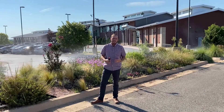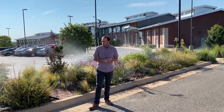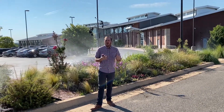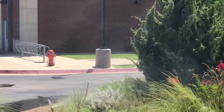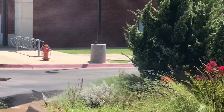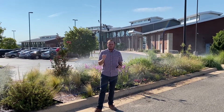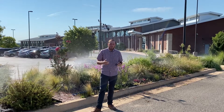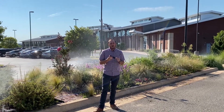Hi, I'm Josh Campbell with OSU Extension and today I'd like to talk to you about managing high pressure in your home sprinkler system. You can see behind me here, I've got our sprinkler systems running. High pressure is pretty common in most home sprinkler systems and it can be identified by hearing high hissing sounds, seeing a fogging and misting of your sprinkler water as it's coming out of the irrigation system. What that does is it makes the water droplets so tiny that they end up drifting off in the wind and don't land on target where you want them to land. By addressing high pressure in your sprinkler system, you can save a lot of water and a lot of money as you irrigate your landscape.